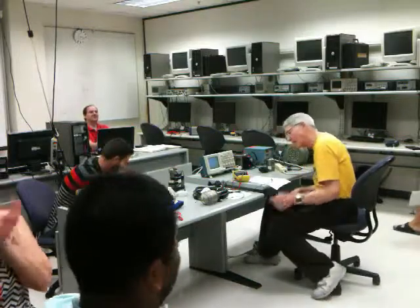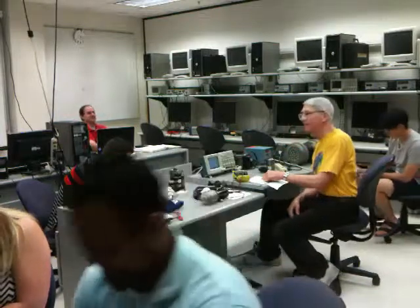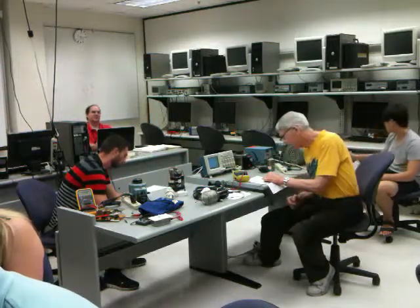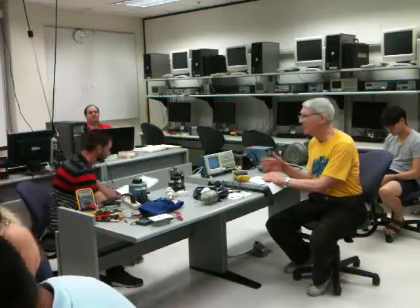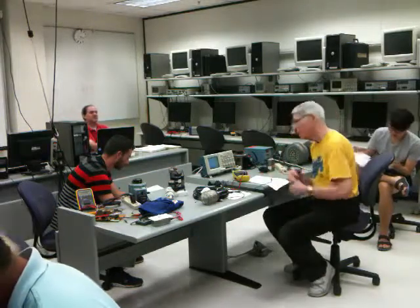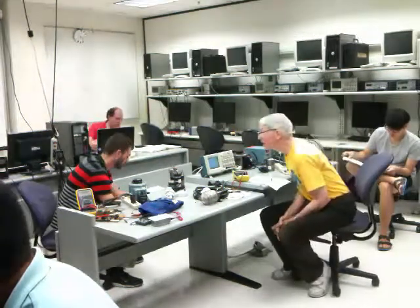All right, we're ready for the next part. 120 volt RMS motor, 1.8 amps, lagging by 50 degrees. Is this fan going to be qualified for that condition? Close enough, you think? It was supposed to be 50 degrees, and we didn't have that, 2.5 milliseconds, so the angle is a little off, but pretty close, and 1.8 amps, we saw that. 60 hertz, 120 volts, how much capacitance should we need? Everyone should calculate this. 30.5.